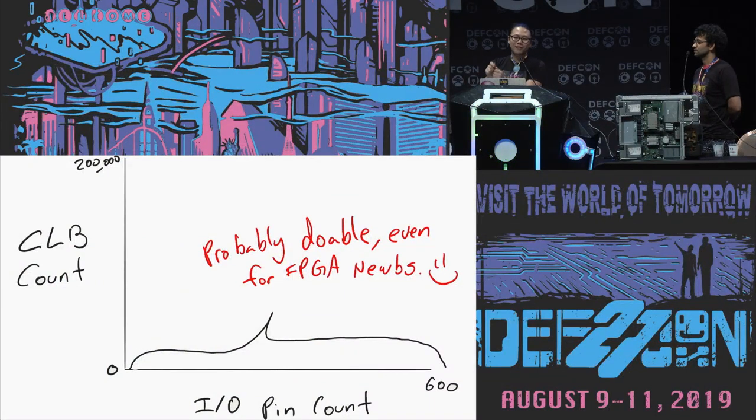If we can disconnect the pin, right, and hook it up to something else that we supply, then it's one of those things like, if the FPGA falls in the forest, did it really happen if no one hears it? No, right? Because if we take a pin, disconnect it from its logic, and that pin is still connected to the rest of the circuit board, then we've bypassed that logic, right?